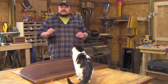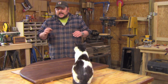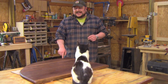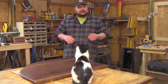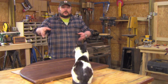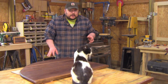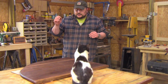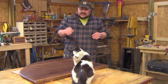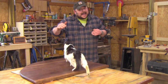Alright, now the next step is, since I have the legs and the shelves stained with linseed oil, I have this tabletop upside down now. I have not finished the other side yet. I'm going to do that kind of all in one go. But I'm going to turn the bottom part upside down on here, make sure the spot is where it's supposed to be, and I'm going to attach it. For now, when I move it in, it's actually going to be in two pieces, but I'm going to attach it once, undo it, and then I'm going to finish the top while it's still attached.